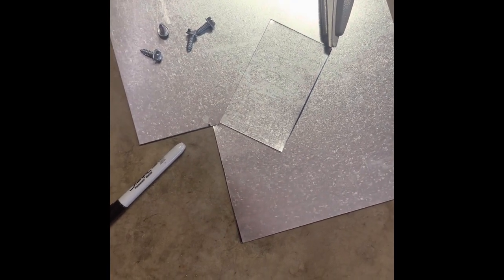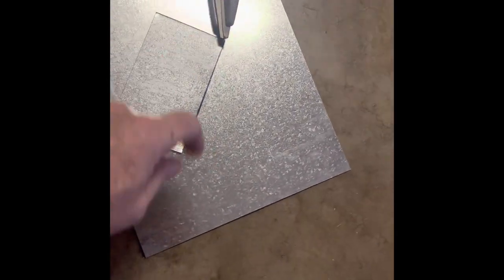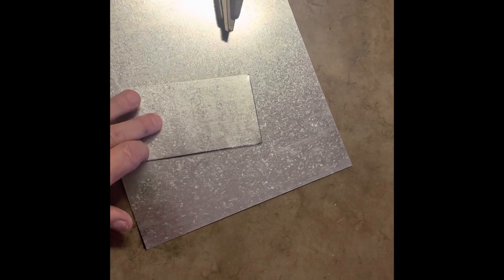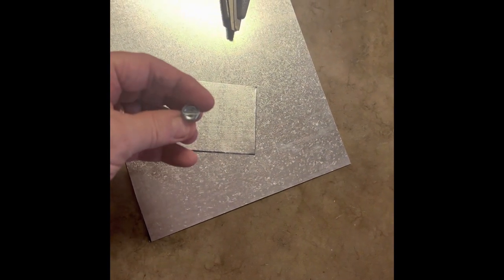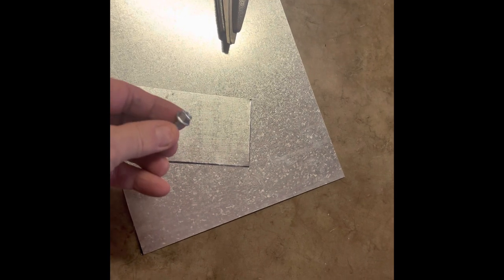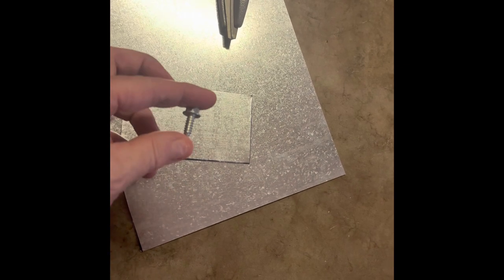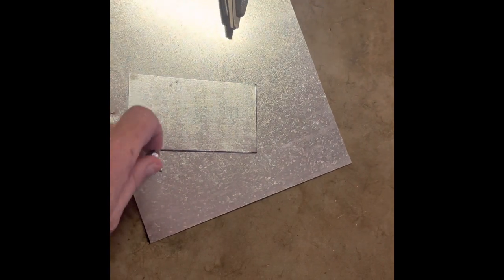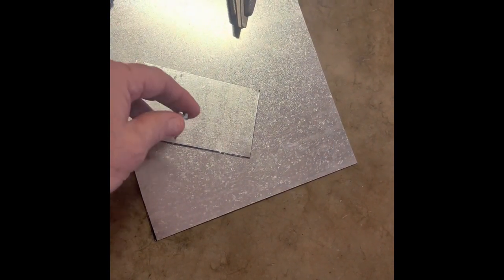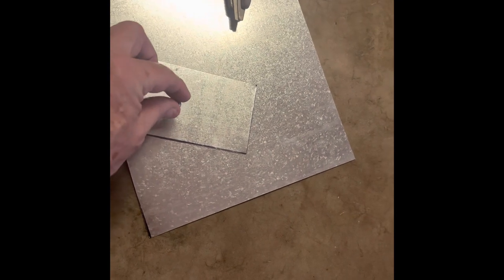I got this steel sheet metal from Home Depot. This plate right here was about $10, and you can use tin snips to cut it. I measured out a little square of what I'm going to put on the garage door. I'm going to use the same kind of fasteners that are already in the garage door — I got these from Ace Hardware, about 35 cents a piece. They're listed as quarter inch by three quarter inch, and they're long enough but not too long. They will screw this plate to the door, and then we'll put screws in the original hinge and screw that into this. This will basically make up for new door sheathing by screwing it to an intact section of the door, and then we'll screw the hinge to this.